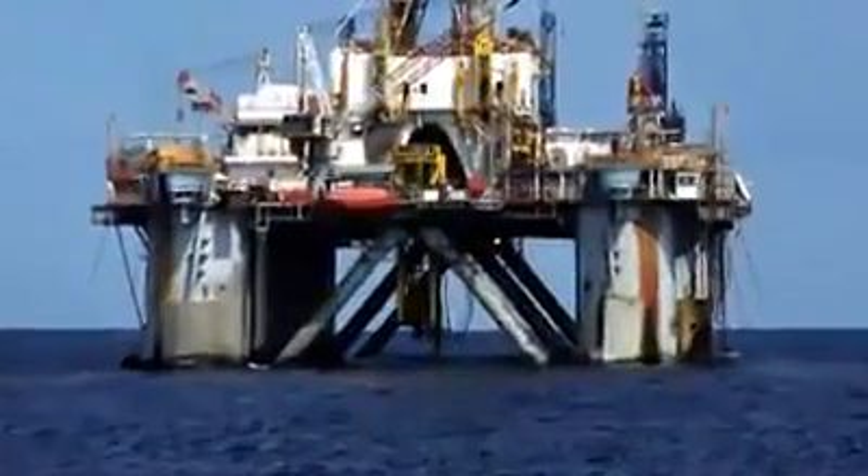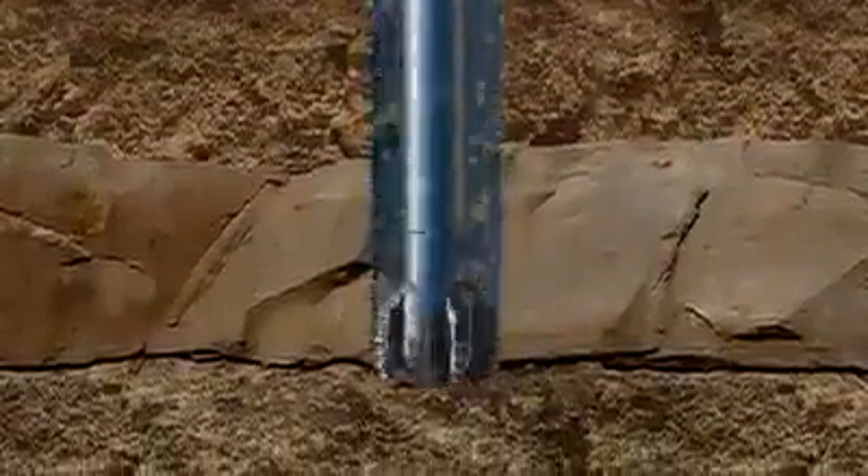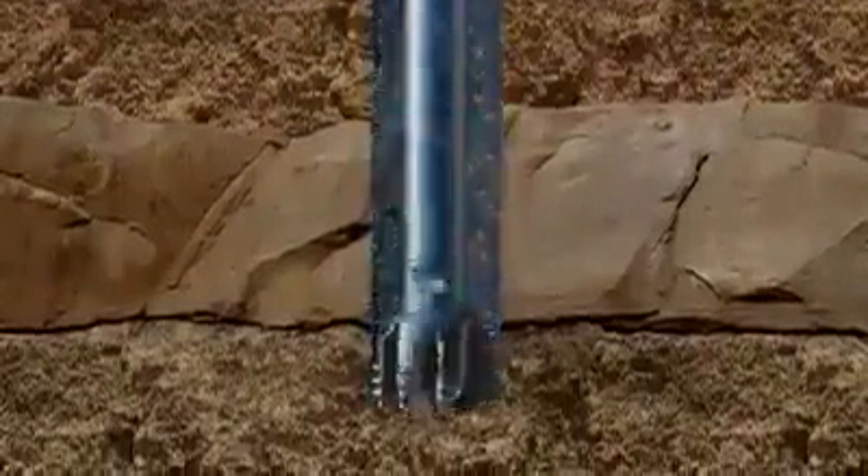Offshore drilling rigs have all the functions of onshore rigs, but also need to stay on station in a variety of sea states and allow for secure connections between the surface and the seafloor. To start an offshore well, a thick-walled, large-diameter hollow tube called a conductor is embedded in the seafloor with the aid of a bit that jets away the sediment with high-pressure seawater. When the conductor has penetrated about 250 feet, the jet bit is retrieved and a drill bit introduced. The cuttings are just washed to the top of the well by seawater pumped through the bit.